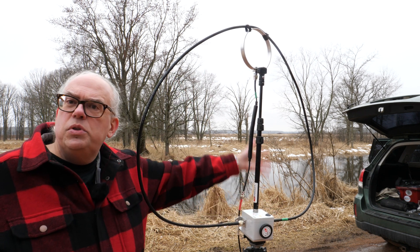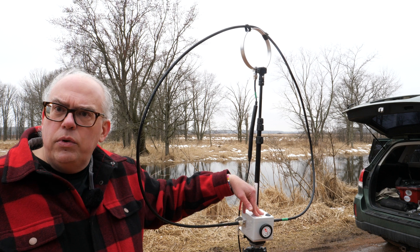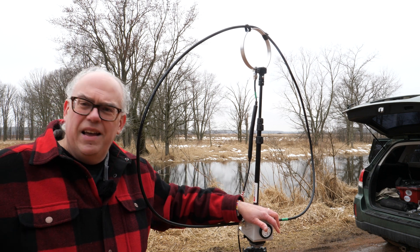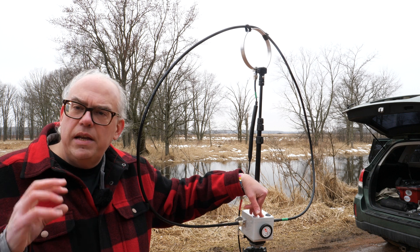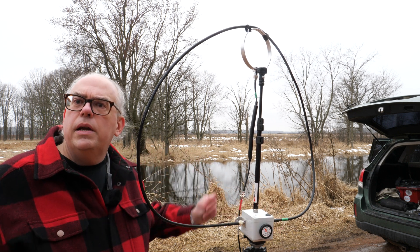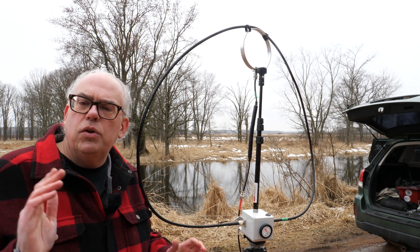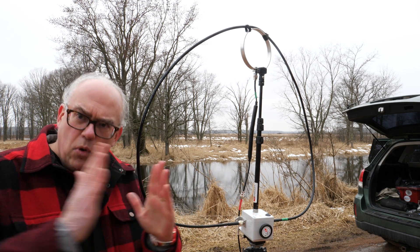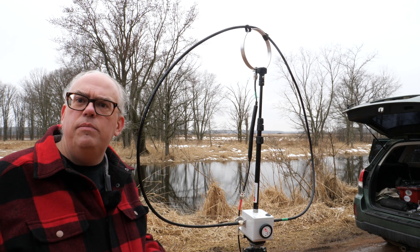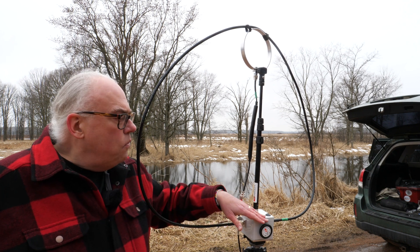Most magnetic loop antennas of that style have a power limit of around 20 to 25 watts phone operation. There are magnetic loop antennas that will go up to much higher RF energy levels — 100 watts and even higher — and they utilize vacuum capacitors that can handle that greater amount of electrical energy without arcing, unlike air capacitors. The second limitation is bandwidth. These antennas have a very high Q or quality factor, so they've got a sharp bandwidth. You get more bandwidth on the upper bands like 10 and 15 meters, but when you get down to 40 and 80 meters, your bandwidth is just paper thin — just a few kilohertz on the 80-meter band.